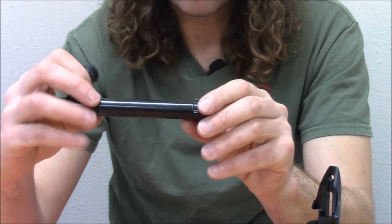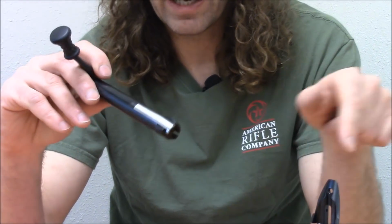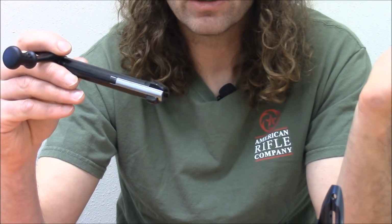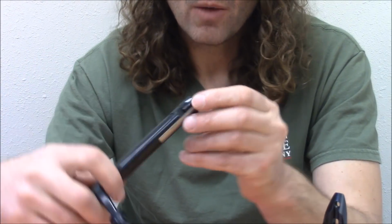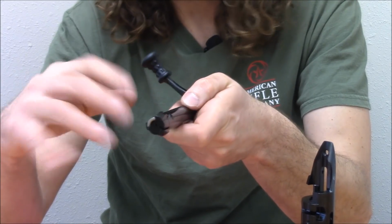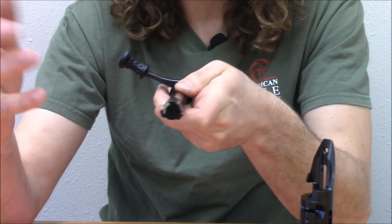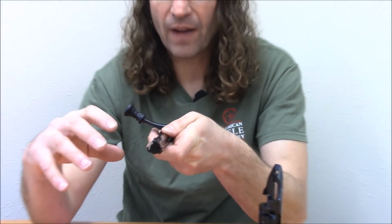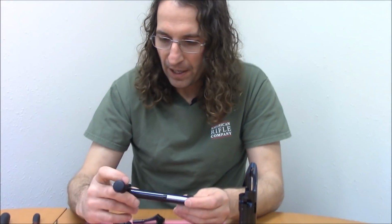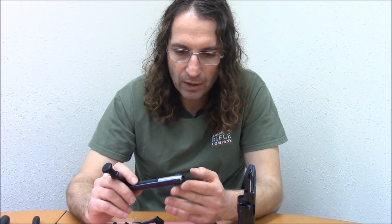The bolt heads are interchangeable, and the bolt heads will be offered in sizes all the way down from 223 all the way up to the 532 case head, which is like a 300 Win Mag. I don't think that I'm going to do this in a 338 Lapua Mag or the Norma Magnums or the Norma cartridges. That's like the 580 case head. We're not going to do that. It's actually, I think, 589 or 590. But yeah, so 223 on up through 300 Win Mag.